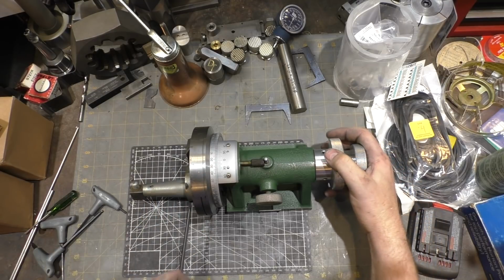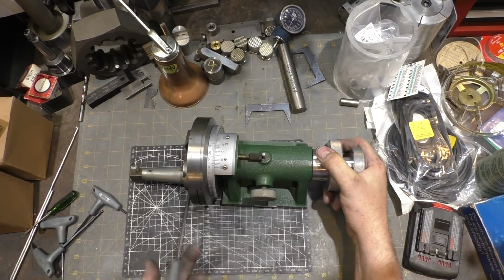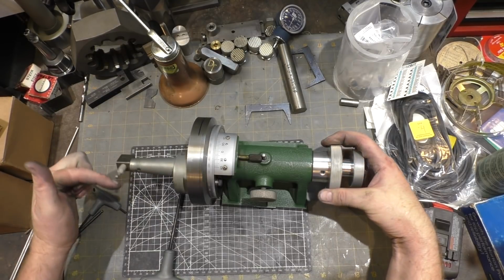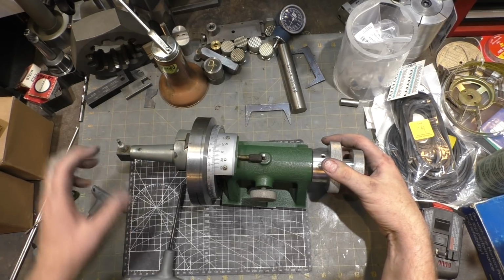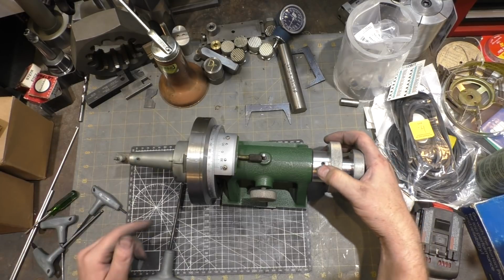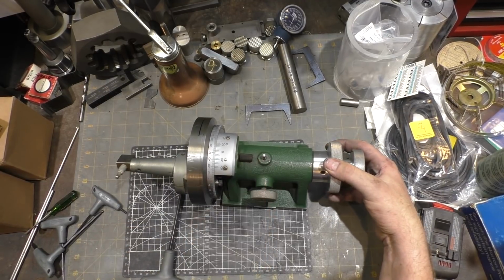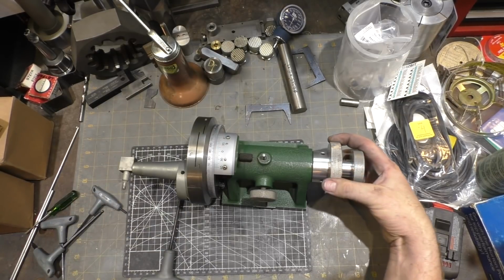If I again take this guy and put it above center line, it is now cutting out an arc that looks like this, and I will be cutting an internal curve rather than an external radius on the wheel, and I can cut that form into a part. If you want it to stop and just do one side, like from here to here, I engage that pin and I set the stops, one on either side here, and now it only goes between those 2 points.